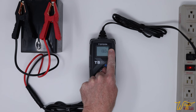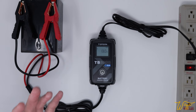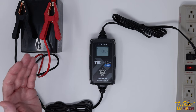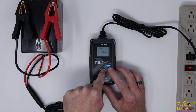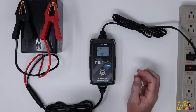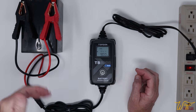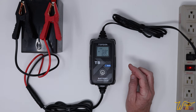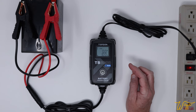Another button press says 12 volt supply. The manual says it will provide a constant voltage of 13.5 volts and a maximum current of 6 amps — maybe you'd connect this to a battery being drawn from in your house, camper, or something like that to keep it trickle charged while under load. Let's cycle back to 12 volt small, and by double clicking it starts the charging process. It shows we're at 90% state of charge, reading around 13.3 volts, and since we're so high in the charge rate, we're at 0.3 amps. A few hours later, we're at 100% state of charge with 0 amps being put into the battery.